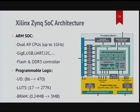So we have this ARM subsystem with a lot of hard-coded blocks in there, like a memory controller, USB interface, and Ethernet, and then you have this AXI interconnect that hooks up to the programmable logic. And there, that's our sandbox. We can do anything there. There's a bunch of I/O going out to that programmable logic. So now we can hook up any interface, any converter, any motor, just by writing a little Verilog code. And we can also accelerate certain functions if that's efficient, like let's say a Viterbi or a Turbo or something like that. In our case, we can then hook up into the memory map of the ARM processor through the I/O. So we've become a shared memory coprocessor. So very, very effective communication.